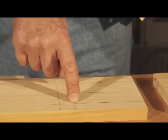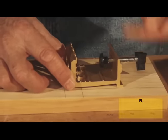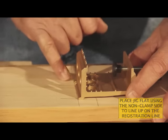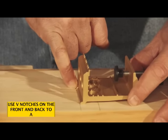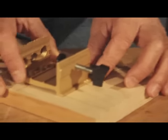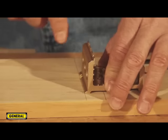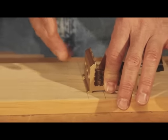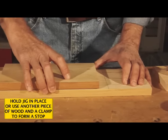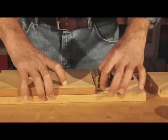So to place a dowel here, here, and here, we would position the jig flat on its back with the thumb screw up and facing you on the board, so that its front edge lines up with the 15 sixteenths registration mark. And the V-notch on the front lines up with the dowel center, as well as the V-notch on the back. We can hold the jig in place when we bore the hole right on this registration mark, or we can take a second piece of wood and clamp it on the registration mark to use as a stop if you're worried about the jig moving around.